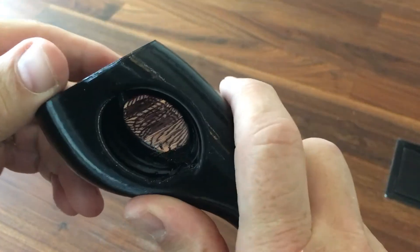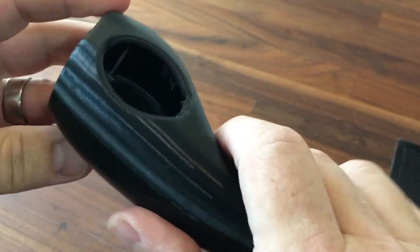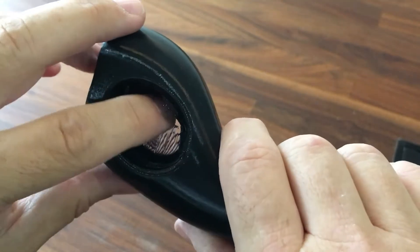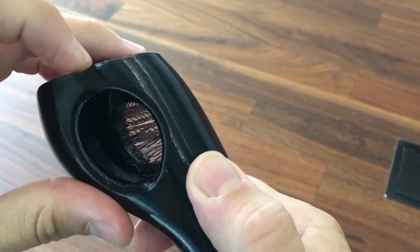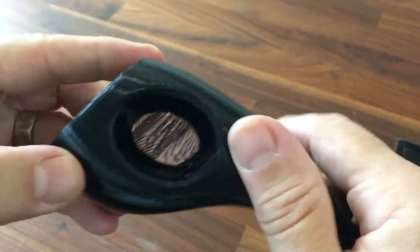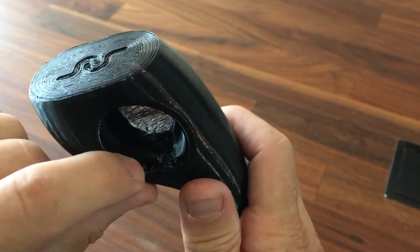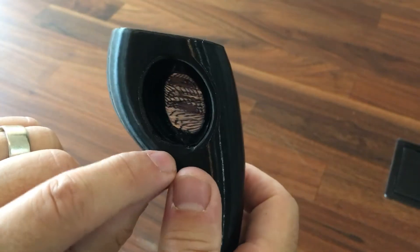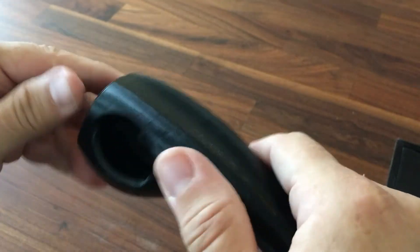I've been having a lot of trouble with stringing on holes with my TPU prints and the string is very hard to clean up. I even tried to design a secondary hole hoping that the path would go there, and I also had a lot of trouble with the top of the arcs. You can see that failing on the build — lots of defects.